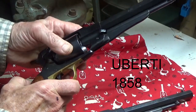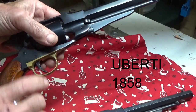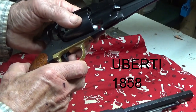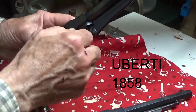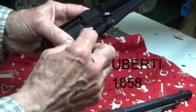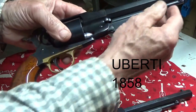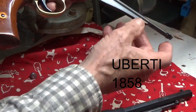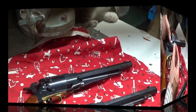No problem rotating it - plenty of room underneath. It dropped down quite a ways though, so my concern might be that it's just a tad small. Maybe I could get these cast at .450; I'm getting around .448, a couple thousandths under what they're spec'd to cast at. For the Johnson and Dow in the Uberti, no problem dropping in and it will rotate - and notice that one's not dropping down because it's getting caught by that larger ring. I'd say that would be a winner as far as loading in that gun goes. The loading lever again has no concaveness - that's going to flatten the tip on the bullet somewhat.